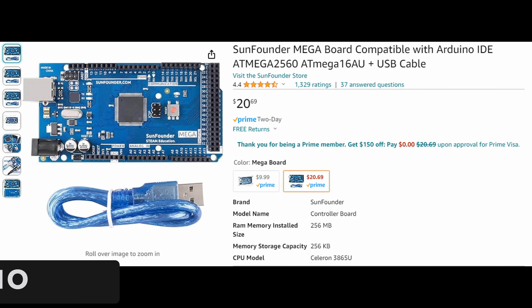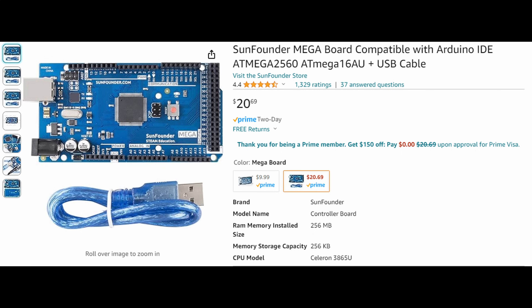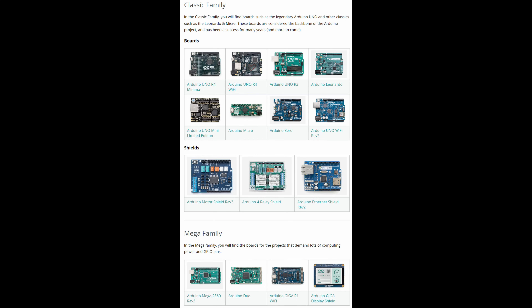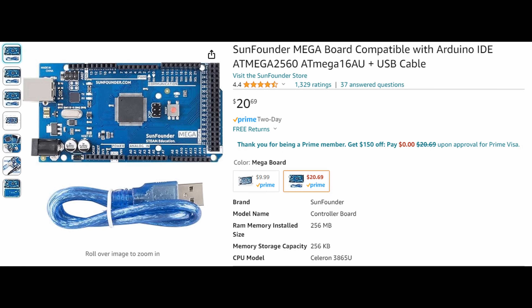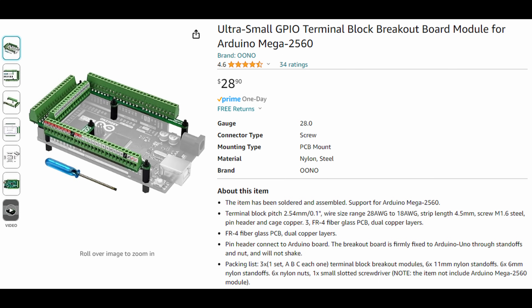Next, how do the relays know when to activate? For this we're going to use an Arduino — this is the brain of the entire setup. An Arduino is considered a microcontroller; think of it as an extremely watered-down computer. When booted up, you can program it to run a line of commands when it first starts, and then it loops over and over again waiting for something to happen. There are a ton of different variations of Arduinos. I chose the Arduino Mega for the additional pins for expandability, though the Arduino Uno would also work if you wanted to save a couple bucks. I also chose breakout boards that allow me to attach wires by tightening a small screw, which lets me avoid soldering and makes future changes much easier.